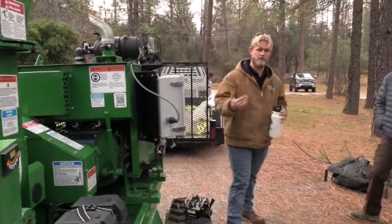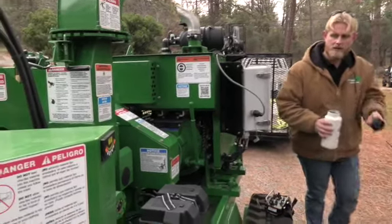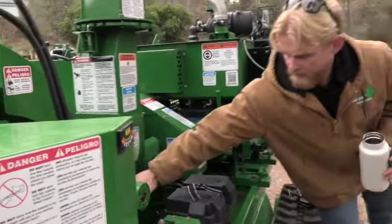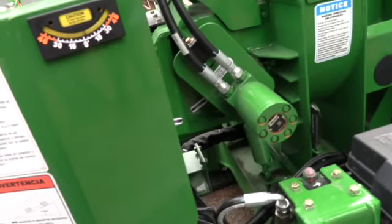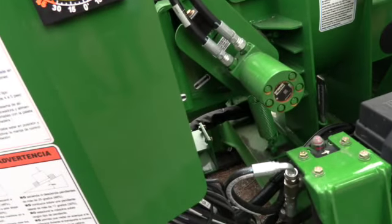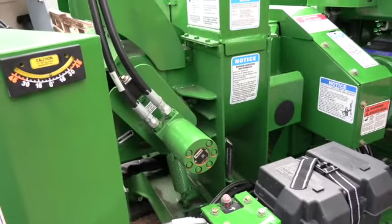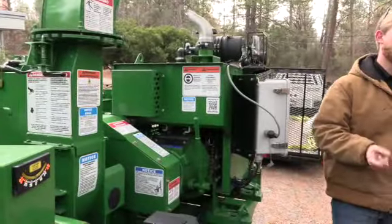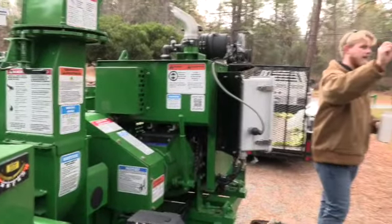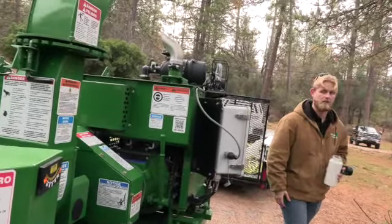A lot of times, especially on these track style chippers, as the machine is moving, if you have any debris that is left right here in this gap from your last branch that went through, while the track is moving, that wood chip may vibrate and it may fall underneath that disc. And then that next time you come to start this machine up and engage that clutch, that disc catches that chip on the bottom of that belly housing and it locks that disc up. We've seen it happen with chips, no kidding, that big. Smoked a clutch on a demo for one of our guys.